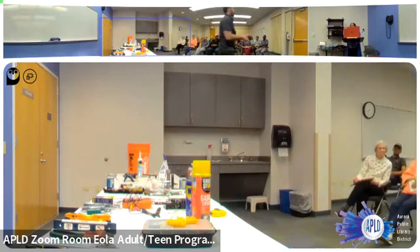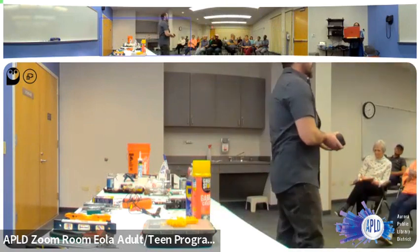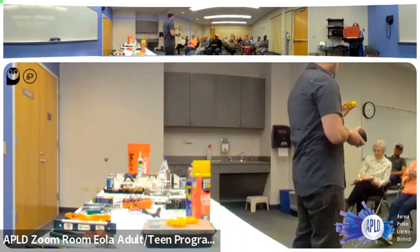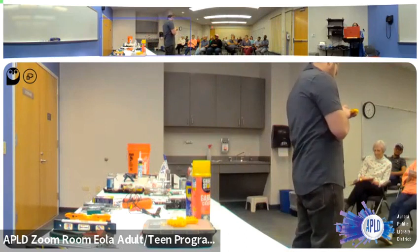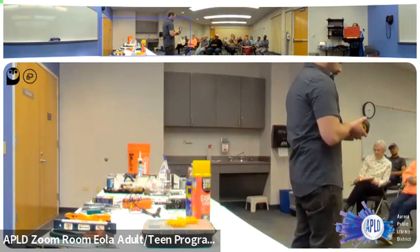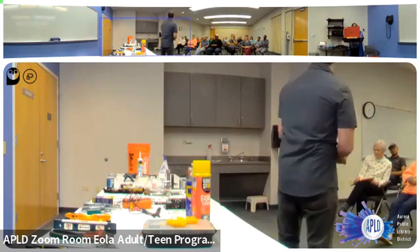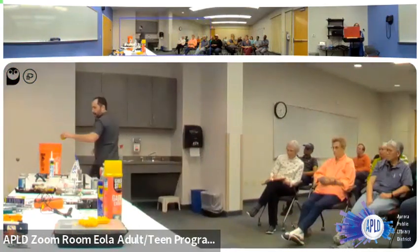So that if I come and measure right here, I can go, okay, that's 33 inches plus whatever that number is right there on the bottom. All the tape measures will have that because, of course, they're different size tape measures. So, right here, 2 3/8 inch or 60 millimeter, boom. That way you don't have to try and bend it like this and guess what the corner is. There you go, tape measures, cool.